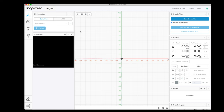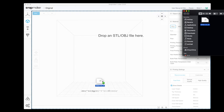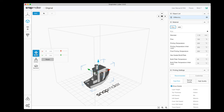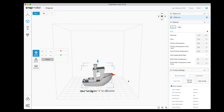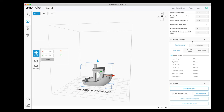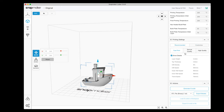When you connect your computer you can control the printer from the dashboard here. I grabbed a benchy file — you just drag it in and it shows up. We can move it around, scale it larger or smaller, and rotate it. On the right side we choose our material — PLA or ABS — and the diameter. Under printing settings we can do recommended or customized. Recommended gives you fast print, normal print, and high quality options, which adjust travel speeds, outer wall speeds, and so on.